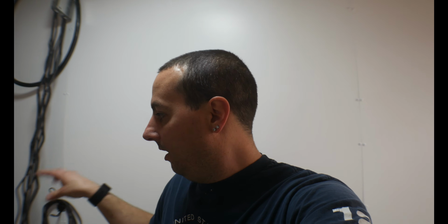I'm running L3 pluses, which pull 660 watts. They're all tuned to 660, so I know what kind of wattage to expect out of all of them, and they're all connected to the same circuit. So you can run 8 of the L3 pluses on the 660 settings on a single one of these, which is nice. And if you're going to run the L7s, obviously you'll have plugs left over, but it's always nice to keep room available in any circuit.